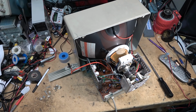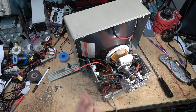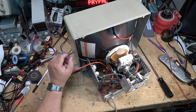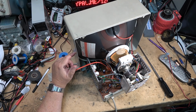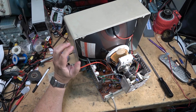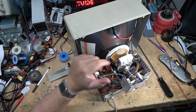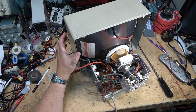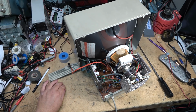And this is back in the day when you could rebuild picture tubes, but of course you couldn't rebuild a tube if it was broken. The rebuilding companies had to get them under vacuum. When they got broken, the phosphor was typically blown out, because when they rebuilt the tubes, they vented them slowly. They used a little tiny drill to drill a small hole into the sealing nipple. It would let the tube vent over the course of 24 hours before they cut the neck off. If you break the seal, the inrush of air is so violent that it will actually blow a spot off of the phosphor, even though the electron gun and everything's there. So if the neck gets broken, forget it. The tube is shot. You're never going to be able to rebuild that one ever.